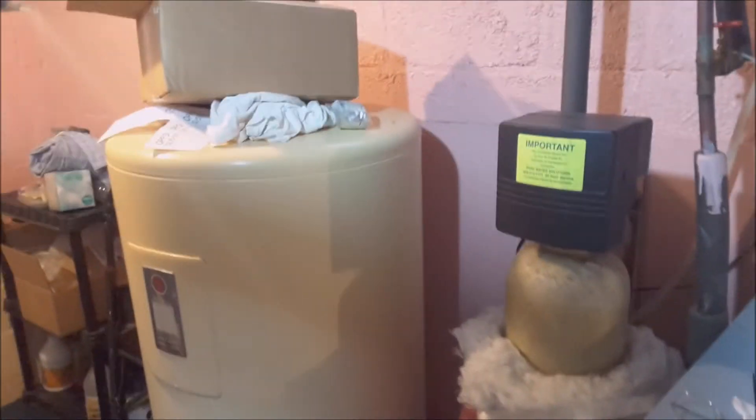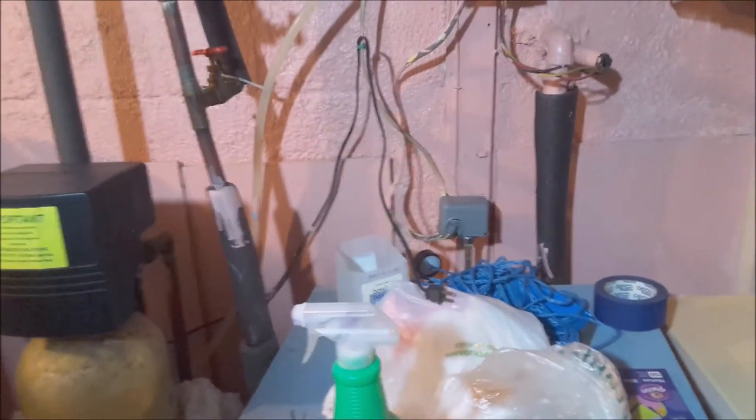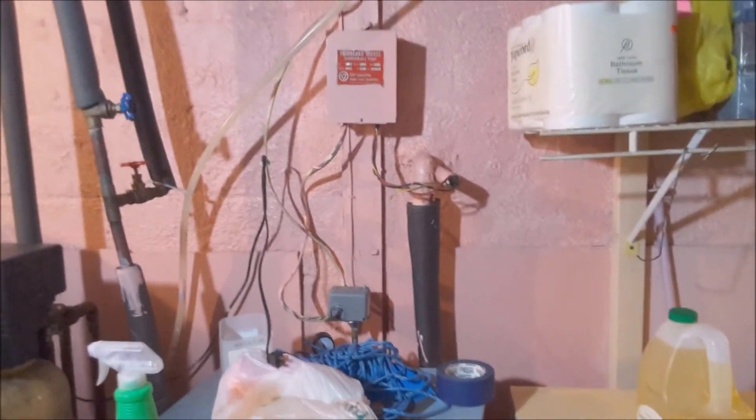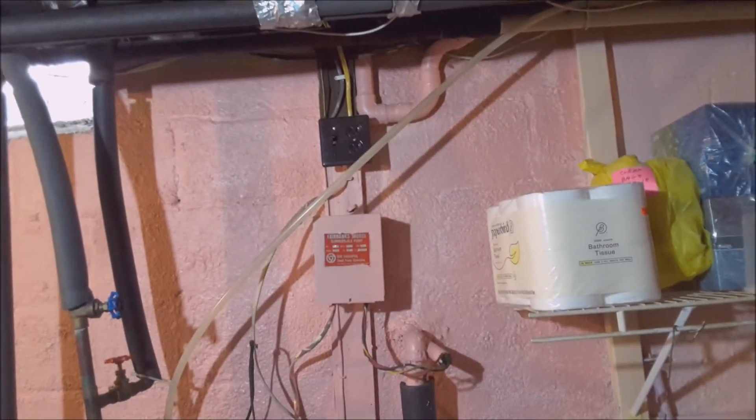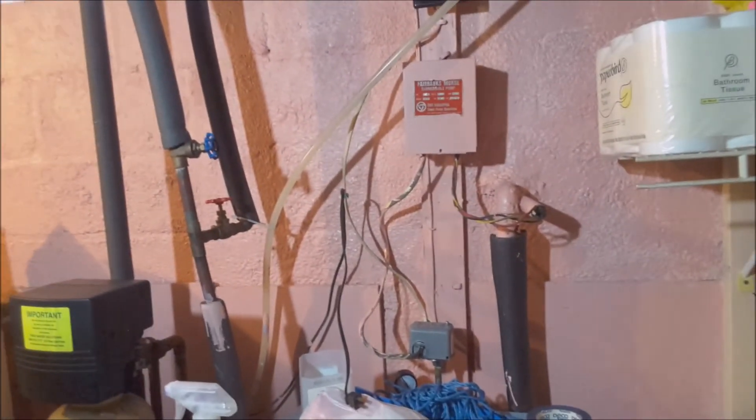It's something that's obviously overlooked often. You can see I had filter insulating material around my tanks to prevent condensation in the basement from the water that forms on them. And here you can see I have a hose attached — I modified it at the bottom so I can always easily drain the system.